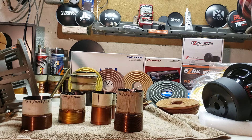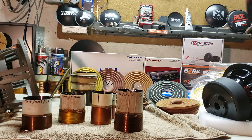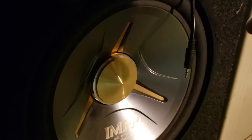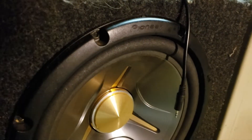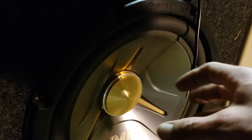That's just a breakdown - there are exceptions to all these rules with different drivers. Here's another cool thing: Pioneer did this in the past - this is actually machined aluminum and these are machined aluminum. This draws heat out the front of the coil. Power Acoustics has something similar but it's a separate piece rather than part of the former. Some aren't even aluminum - they're plastic. You can hear that this one is aluminum. It's directly connected to the voice coil former, so as heat comes up the former it's able to escape out the front.